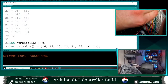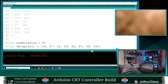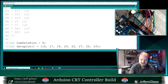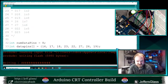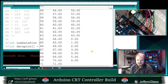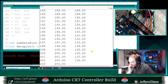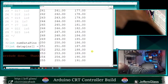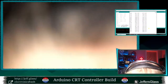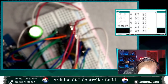Oh, well, maybe this is just not plugged in well enough. That might also be an issue. It's kind of hanging out of the breadboard there. That's the problem with some of these pre-made DuPont wires, the wires aren't big enough to make a great contact. Fingers crossed. Oh no. Yeah, so the 64's pin, which is this orange wire here, is not ever going high.